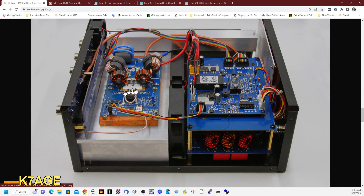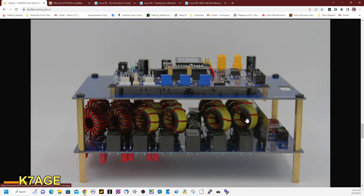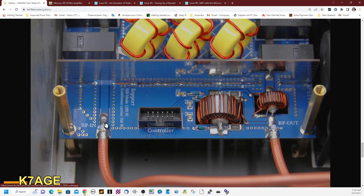Here's the amplifier. There's one transistor — a 1,200-watt amplifier. This is the controller board with what looks like a nano-derivative processor to run it, and down below are the output filter sections. You'll notice the LDMOS transistor is mounted to a big copper heat spreader, which is then attached to the heat sink. This spreads the heat out, and the heat sink dissipates it along with a fan. You can see the bandpass filters underneath there.